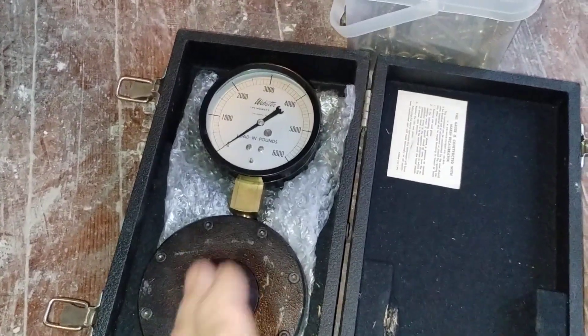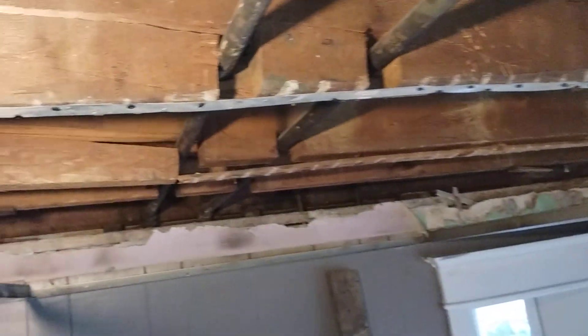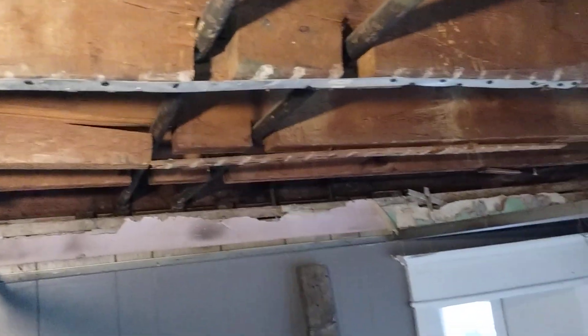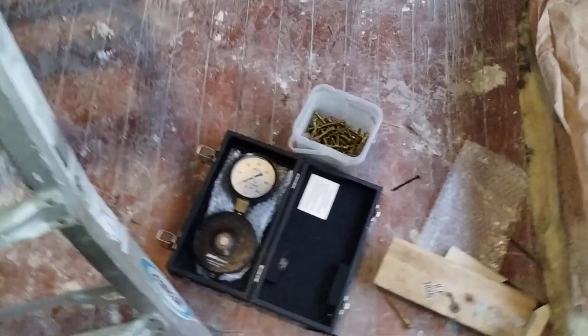I'll get the value and know what I'm working with – I need to know if this unistrut is capable of staying rigid. Once it's rigid across there, on the side that's flat, it would be at a plane, gets lifted up, and then secured into the side. Ideally it transfers load over to the wall. But if it strips the wood out, it doesn't hold long-term. This is just a sample experiment – it's not the ultimate fix. Even if it does hold it up, I'm still going to go with the flitch plate. Look up 'flitch plate' – F-L-I-T-C-H – that's ultimately what's going to be made on each one.